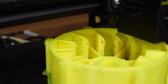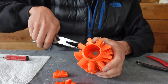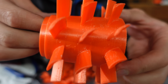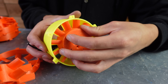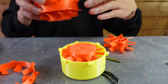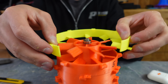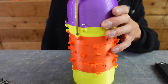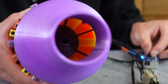Moving on to the axial fan. This one was a lot more tricky to print because all the blades were overhanging, so I had to use a lot more support material. This generally leads to poor quality surfaces, which are not good for aerodynamics. But until I get a resin printer, that's just the way it is. In order to fit the stator rings around the rotor blades, I had to cut them and bend them around the rotor. The lowest rotor blade section connected to the motor, and the motor was connected to the housing. A stack of three rotor blades went on top, then I put a steel shaft down the middle, and two more layers of rotor blades went on top of that. Then came the final stator and a bearing in the nose cone to constrain the rotor from the top. I screwed all the layers together and spun it up for the first test run. I was pleasantly surprised there wasn't very much rubbing — my tolerances were loose enough, but hopefully not too loose to pull a good vacuum.